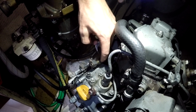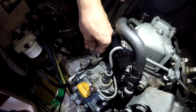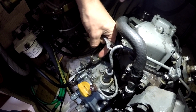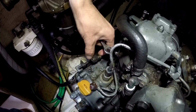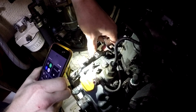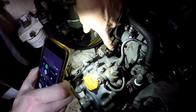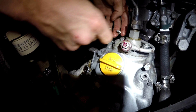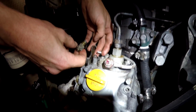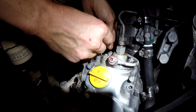Well, we got this back lock nut loose. Finger loose, right? You can just adjust that. This one, however, is this whole sleeve. This is all one piece. See how you can see the threads inside there? This is threaded onto the shaft. No big deal. We're going to thread it back on, take up some of the slack that we had, about a quarter inch of slack, and see how that goes with the regulator once we get the engine started again.